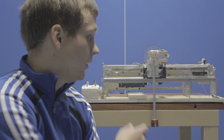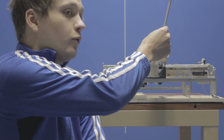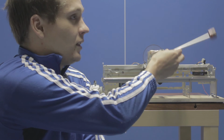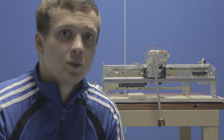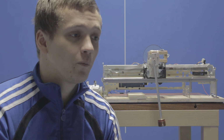The problem of that is that you really have to be careful, so the pendulum has to come to a stop almost by itself. So you can't have it swing up and have much speed at the top, because then the controller won't be able to catch it. It basically has to swing up and come to a stop by itself so that the controller can catch it. And the next problem is, because I've just simply hard-coded the movements, even the slightest change of the setup makes it not work anymore. So it might work one day with the same movements, and the next day when it's 2 degrees colder or 2 degrees warmer, it won't work anymore.